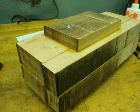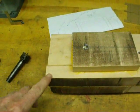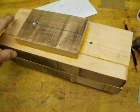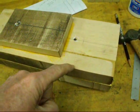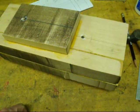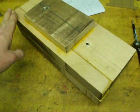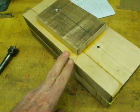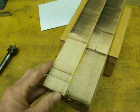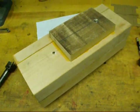One thing I might do before I put it in the lathe: there's an awful lot of wood on here, and I hate to reduce it all to shavings — it's just an awful lot of tedious work. So I'm going to saw off some of this that I know to be waste stock on the bandsaw to save me from turning it. Sometimes we even attempt to knock the corners off before turning to make it less clunky.